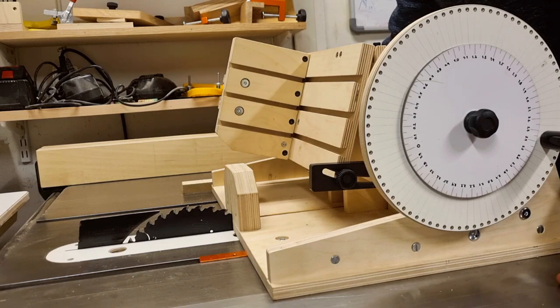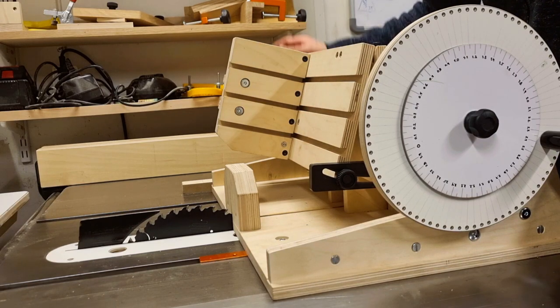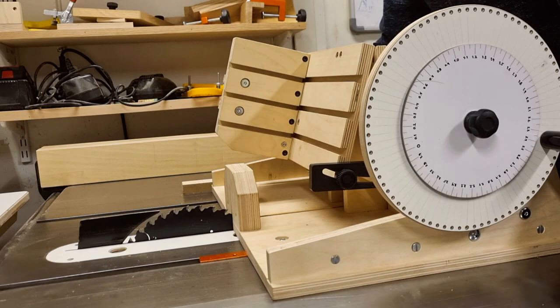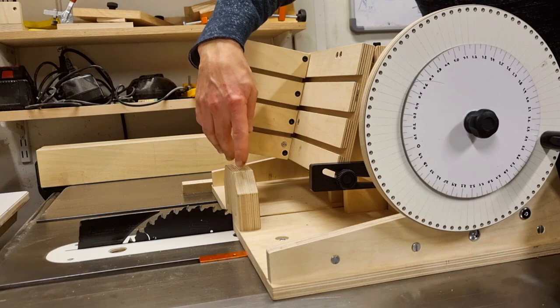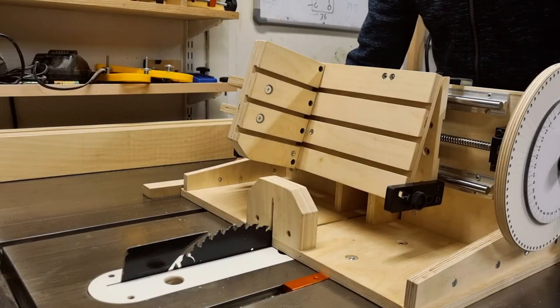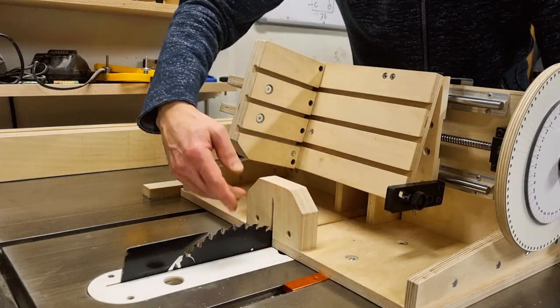As I said, you are a bit on your own on this one and I don't want to change the entire jig to run higher angles. But if you want to run thicker pieces of wood at a high angle I have a few tips. The quick and dirty solution is to remove the front support at those occasions — I've done it myself a few times and then put it back afterwards, and the jig will survive that very well. A more permanent solution would be to extend the bottom plate in this area to move the front support outwards.